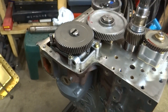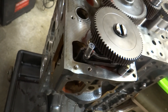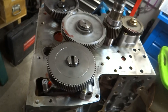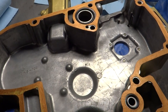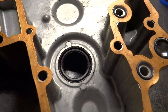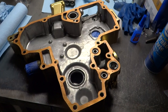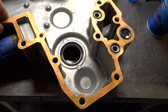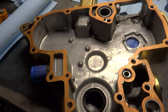What I'm trying to do is get everything set up for the injector pump to fit in there. Based on the manual and my disassembly pictures, one of the springs actually attaches to the timing cover itself, so I need to put that on before going further. The kit came with three different gaskets and this one fits best. I sprayed copper gasket sealant on it - it'll seal against oil leaks and act as a glue to hold the gasket in place.